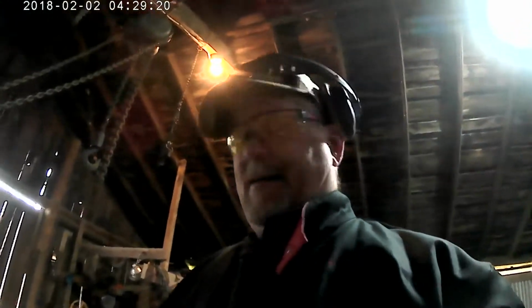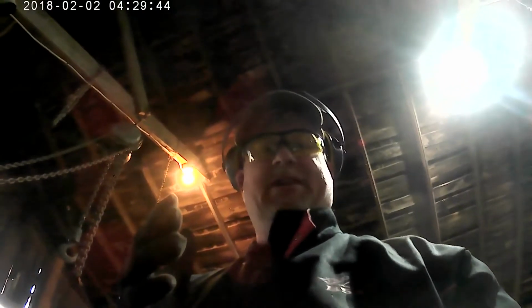That also gives me a nice clean weld edge to weld to, so that's good. Alright, well, we got those cleaned up. I didn't completely clean both ends. The end that I'm welding, I needed to get the paint and the rust off so that it would weld better. But they didn't necessarily need the inside cleaned up because nobody's going to be sticking their hand down it. The other end, if the inside had sharp things on it, then I was trying to clean those up. But some of them didn't need cleaning at all, and other ones just a little bit. So that was that process.